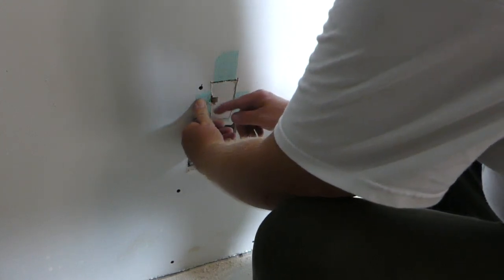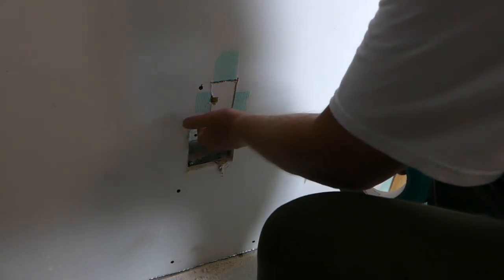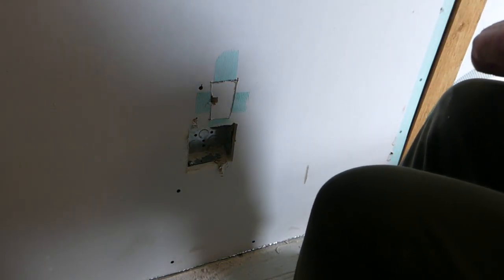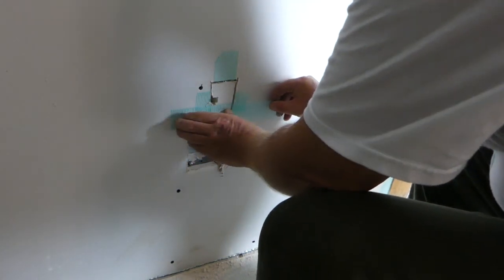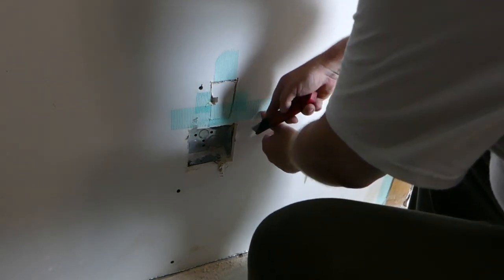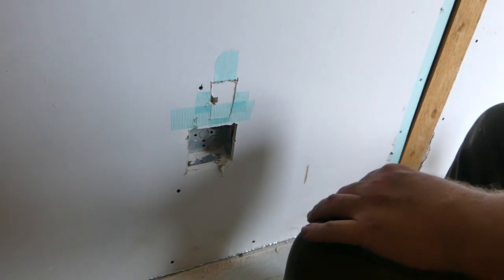And that's a handy part of this particular tape. I'll go ahead and put a piece on the bottom and make sure, yeah, I cut that right. It's doing it. I'll run one here that way. So there you go. And then when I float mud on there, it'll just fix right up. My mistake won't even show up. Everybody can feel good, including me. And also, because I cut that so thin, I want to reinforce that a little bit, so it'll reinforce it at the same time.